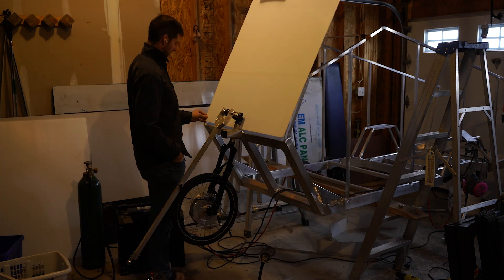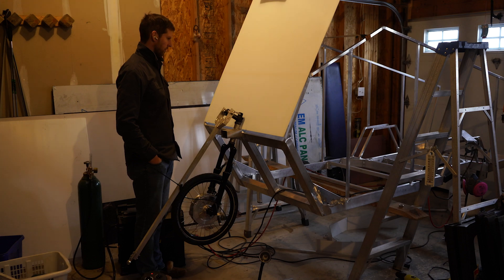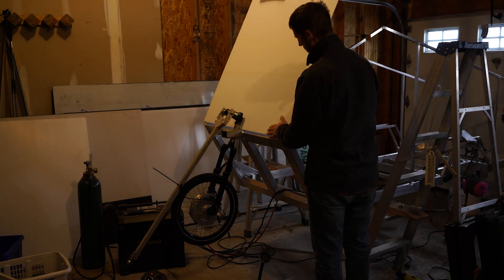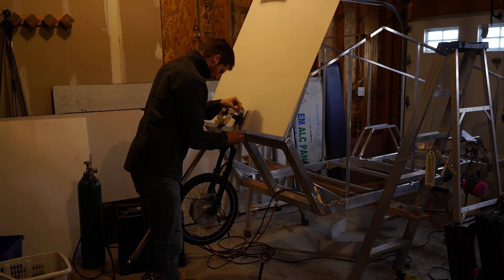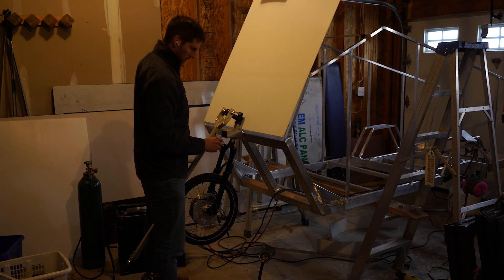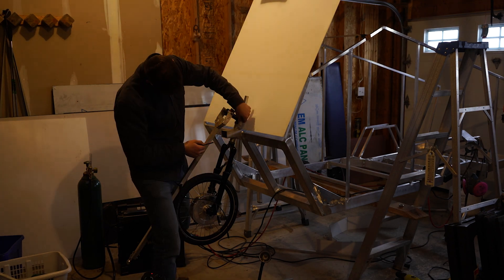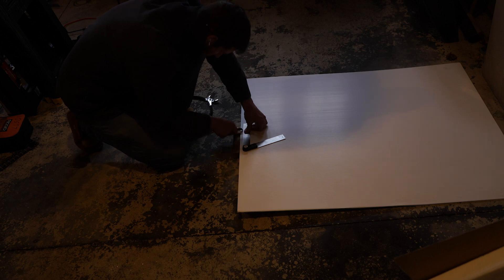When looking at materials to skin this thing, I tried out coroplast but it was a little too flexible for my liking. I was trying to save weight but in the end decided to go with aluminum composite panel, and I got an amazing deal — all the panel I need for $70 Canadian from a sign guy basically giving it away. It's almost twice as heavy as the 10mm coroplast but more robust and resilient. So I'm using the coroplast to create a template for my cutouts on the ACM panel.